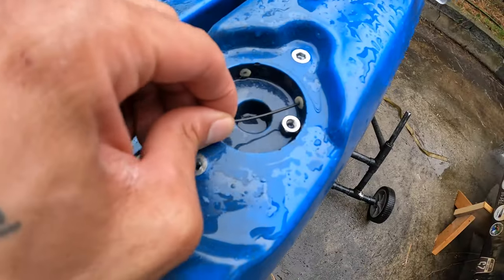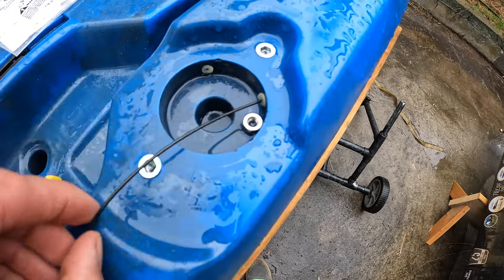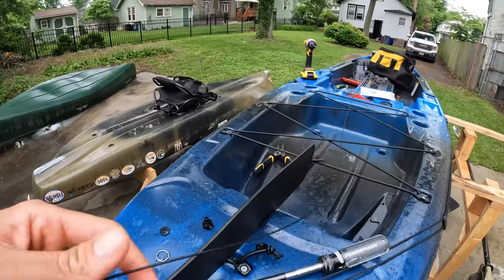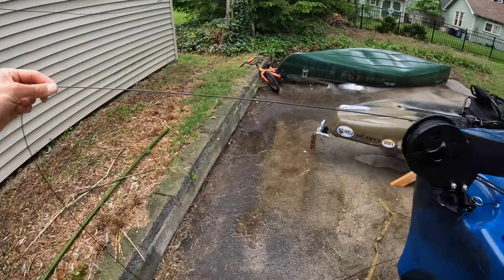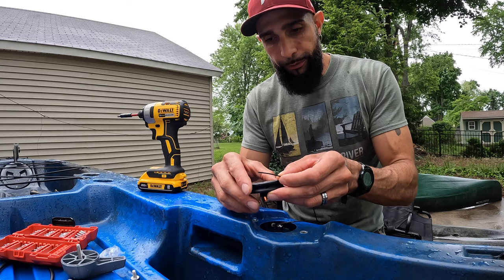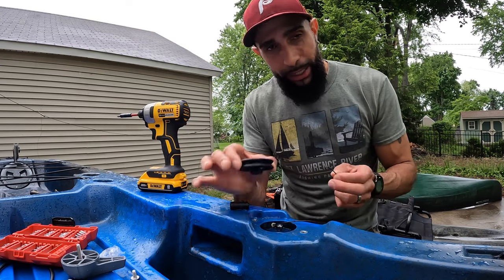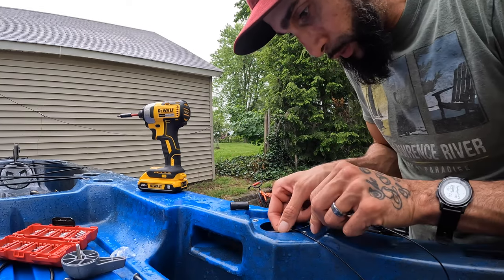Take off the steering knob — it'll give me access to the original cable underneath. I will pull out the original cable and then put in the brand new cable. The cable runs through the pulley, so you do have to loosen that lock nut as well. All you have to do is feed the new cable through that same eye that you pulled the old cable out of. I've got that first side of the cable secured, estimating how much I'll need — probably another 18 to 24 inches. That should give me plenty of excess cable. After you clip it, go through the pulley system in the right direction, so pay attention to how you took it out and put the clipped end through the opposite hole.